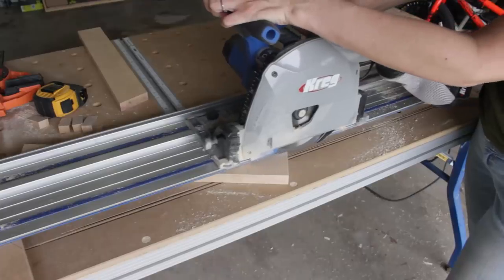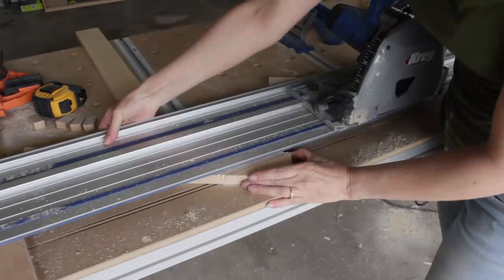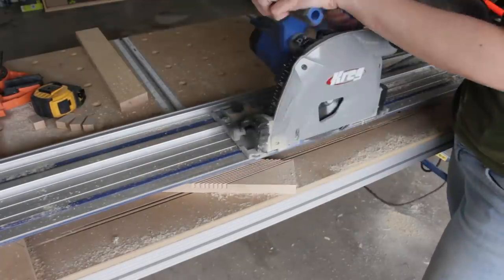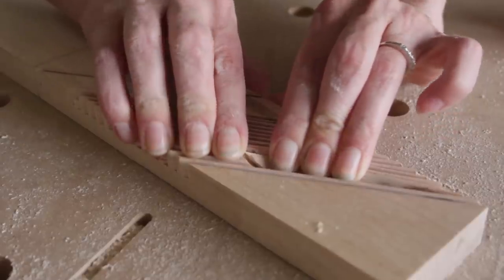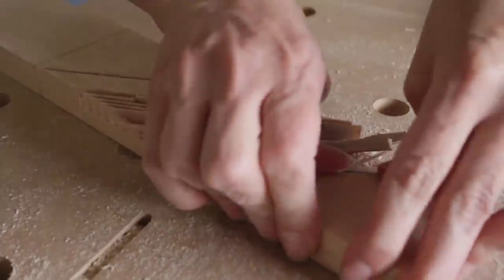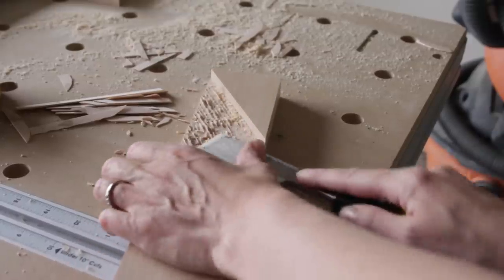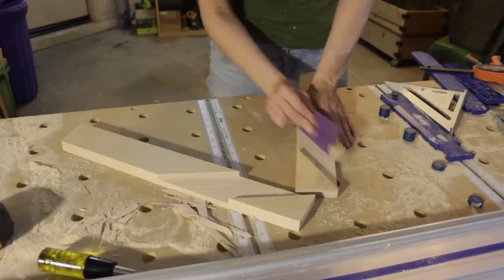I began making multiple passes to remove the area of the joint. After making the first cut, I simply slid the board over about an eighth of an inch and made another pass, stopping just before I got to the second pencil mark. I then got to chip out the waste area — definitely the most satisfying part of the build. With the bulk of the waste removed, I switched to a chisel to clean up the joint a little more, and used a scrap piece of wood with sandpaper wrapped around it to ensure the bottom of the joint was nice and flat.